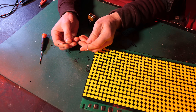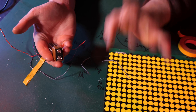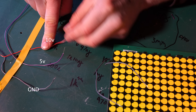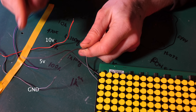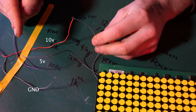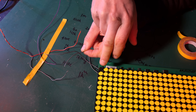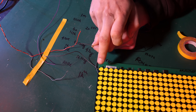There's a slight issue here. If we have loads of them and we have to switch the polarity all the time, it gets quite complicated with the circuitry and wires. It's basically looking for an electronic potential difference between two points — be that a battery with a plus and a minus. We could actually use three wires: ground on the grey wire, five volts on the purple wire, and ten volts on the red wire. We get one of the two wires from the Flip Dot and put it on the middle one — the five volts. Now watch: when I touch the ground and then the ten volts alternately, you'll see I'm able to change the pixel just by changing one wire. When I touch the ground wire, the potential difference is between five volts and ground, so the magnetic orientation causes it to go to the black side. When I connect it to the ten volts, it goes between the five and the ten — that's the potential difference and it ends up flipping it again.